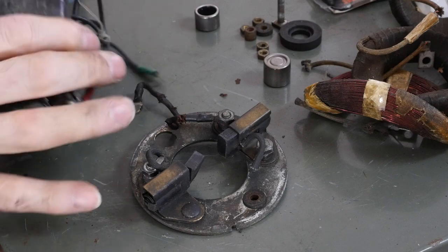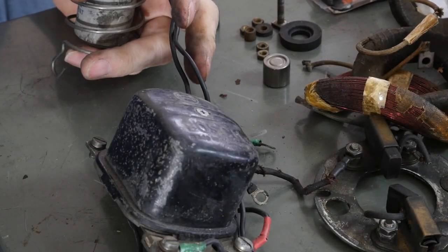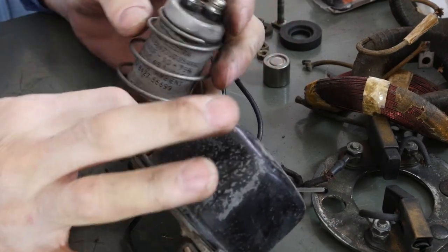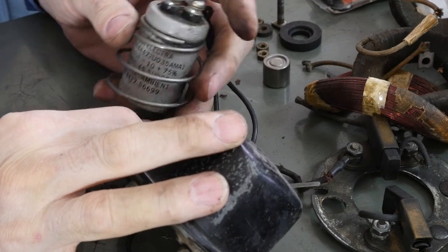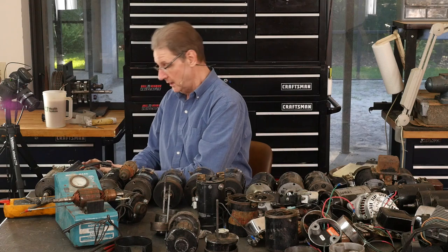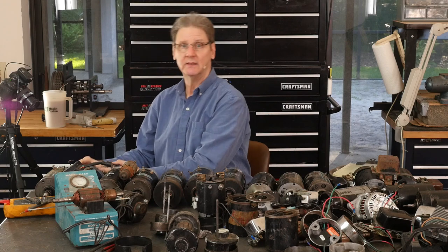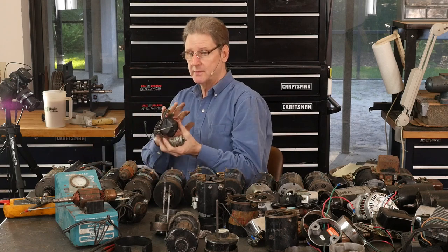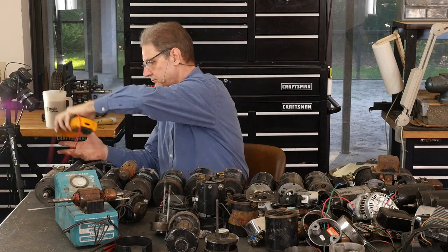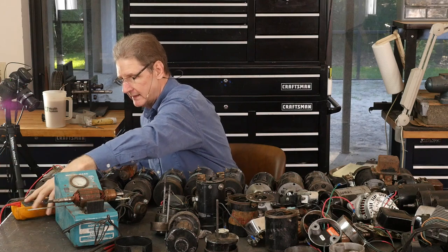This is a kickstart bike, maybe a magneto, and the lights flicker at idle. So they used to sell these battery eliminators, which is a big, giant capacitor. I would put a battery on the bike because I've got a broken collarbone from getting hit from behind at a stoplight. So I like my taillights bright and working and not flickering. That was one of the worst things about when I had my 62 set up as a magneto bike. What else? Well, there's an ohm meter. You can measure, see if your field coils are dead. Well, like I say, we'll get into this next few shows.